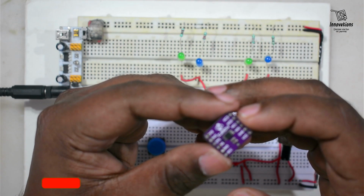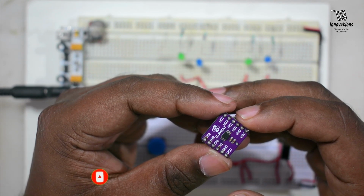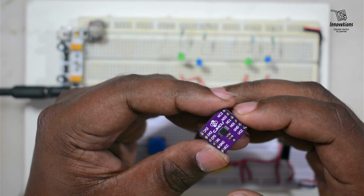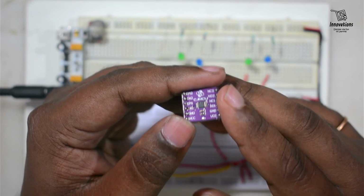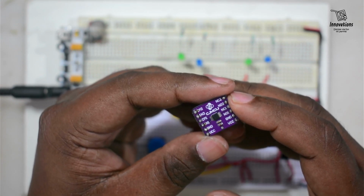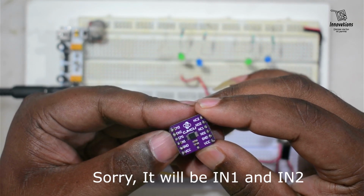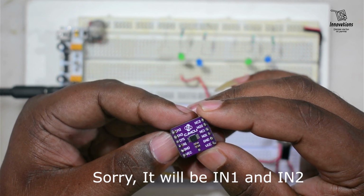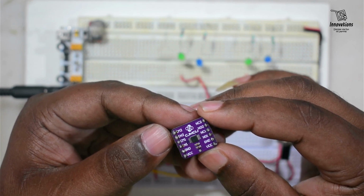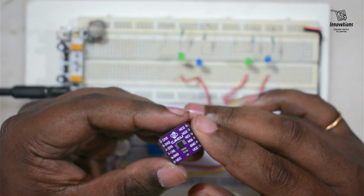This switch module is supplied with 5V DC as VDD and can switch 1.6V to 5.5V driving lines, compatible with more logic level circuits, which can eliminate the need for an additional source voltage line for the driving line and can replace it with the same VDD. This module has 2 channels, 2 poles and double throw. The on resistance is very low, about 10 to 15 ohms. The control pins, that means IN1 and IN2, are 5V tolerant. Operating voltage is 1.65V to 5.5V, maximum load current at the control pins is 50 milliampere and maximum operating temperature is 125 degrees centigrade. So these are the technical specifications of the module.